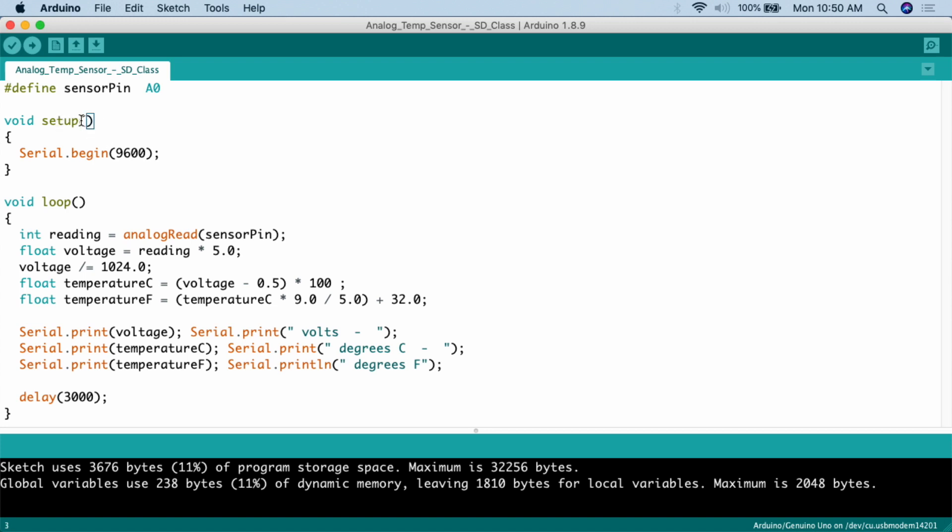After that, we go to setup() to set up the environment the code will run in. All we're going to do is turn on the serial monitor service: serial.begin(9600). Since this is an analog pin, analog pins are always used for input, so we do not have to define how the pin is going to be used. If we were using a digital pin, we would use the pinMode function and specify input or output — but analog pins can only be used for input, so that step is skipped.